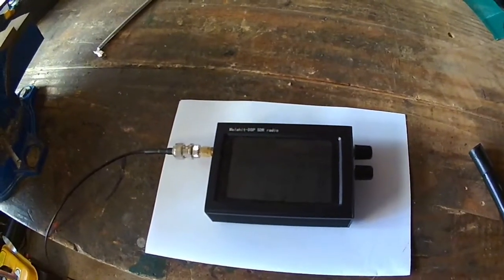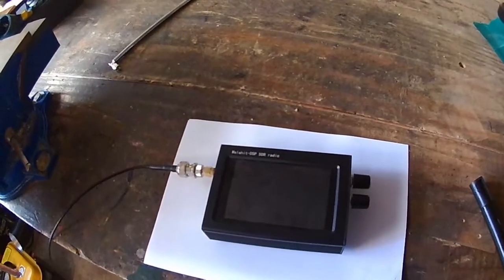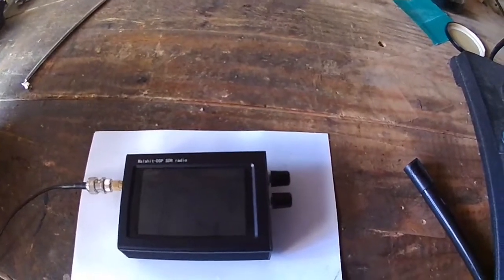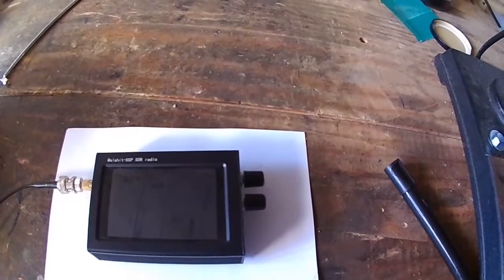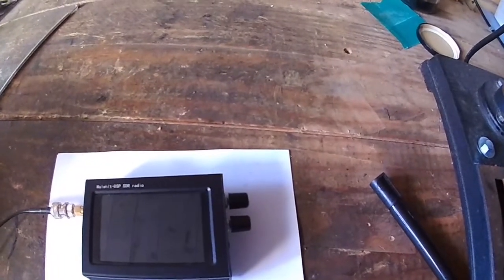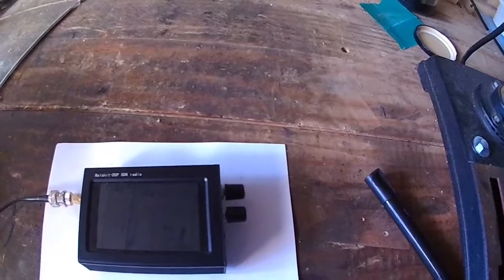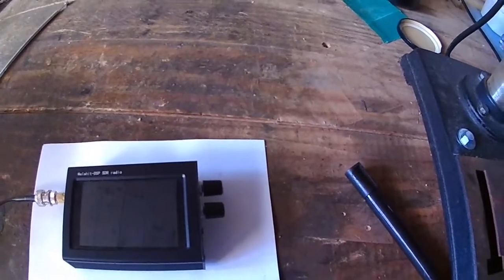And there we have it. All it was, the pull down resistor had failed somewhere on the circuit, and I just added another one. And as I say, that connection to the switch, to switch it on, just needs the positive voltage from the battery. And when you release the switch, then that wire should connect to earth via a pull down resistor, and it was hovering between the two voltages, between 0 volts and the battery voltage, and it was just floating.